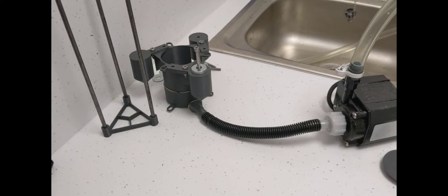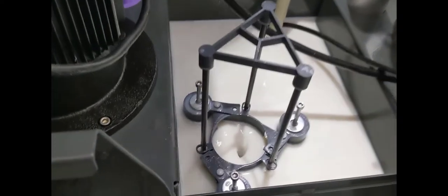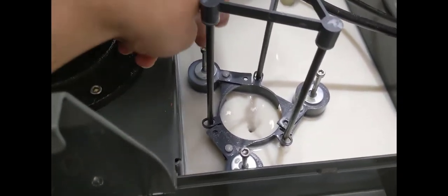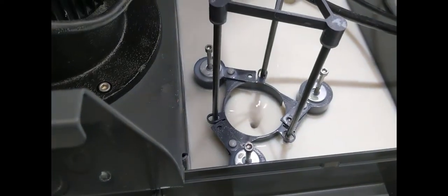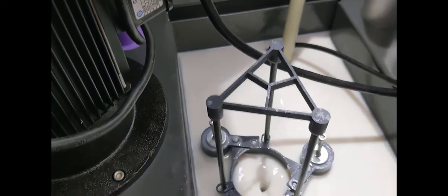Here it is actually working at the back of my Haas UMC. You can see a good spiral going down. It sits at the right level — I could add a few more washers if I wanted it slightly higher. The pump is underneath the water, the pipe comes up out through the coolant coalescer. Coming around to a different angle, you can see it comes up into the coalescer where there's a green mesh that causes it to settle, and you can see the oil starting to settle on the surface.